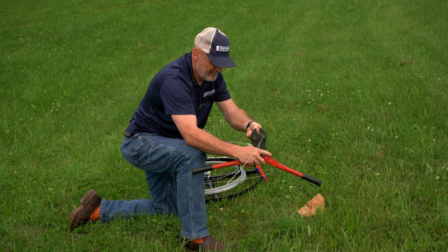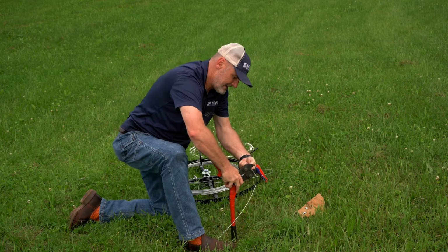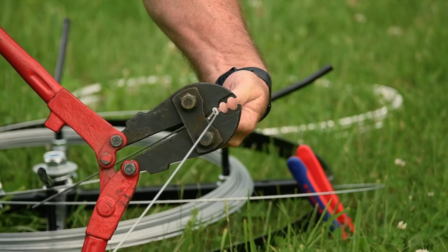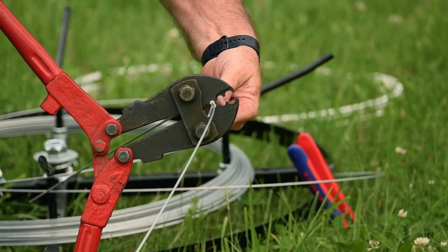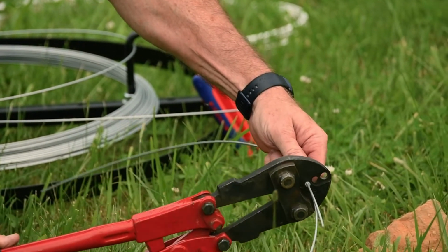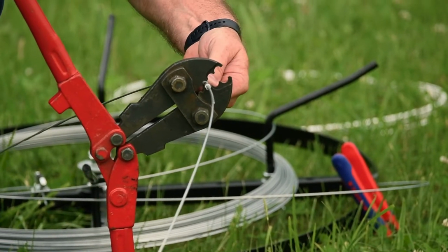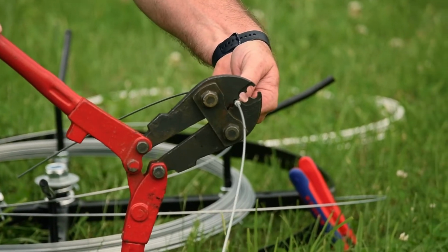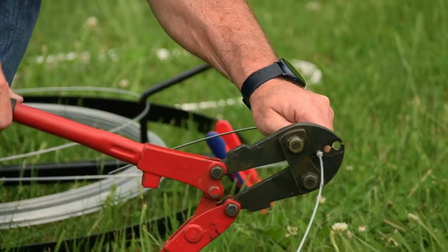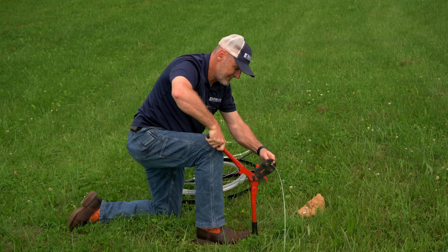Now this time, get it all aligned. Again, the ground is your friend. Get your proper alignment, starting right out at the end of the crimp itself. Press down and back up. Because this one is a long, the width of your crimping tool won't catch all of it. So I'll catch this one about 3 times.